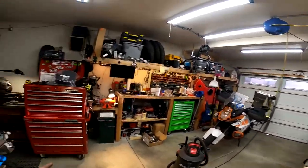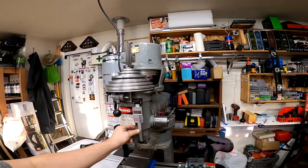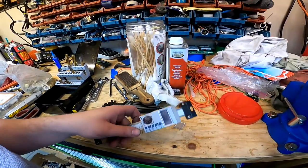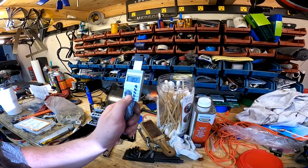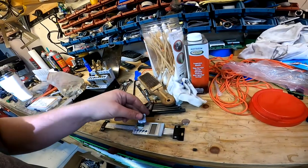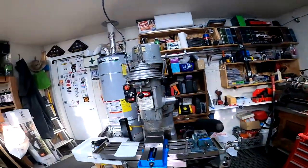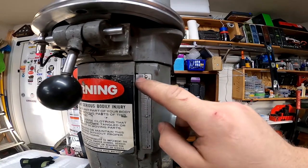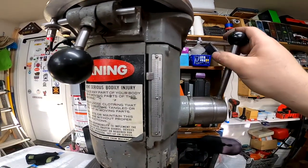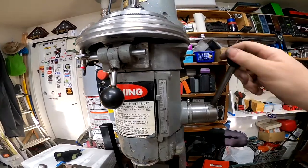That'll happen pretty quick. And I'm actually going four-axis on the DRO. So I picked up one of these guys — this is going to be a quill readout. This will mount somewhere around here, and that guy right there goes on the quill. Every time you move the quill it tells you how far you're going. It's a lot easier and more accurate to look at the digital readout on that than to try and read the little tick marks.